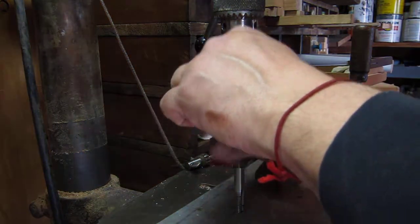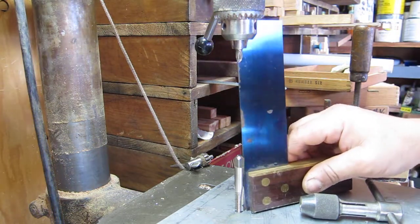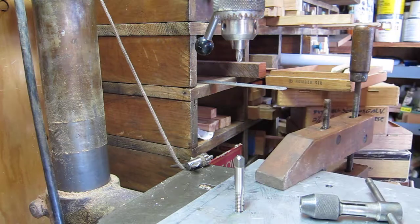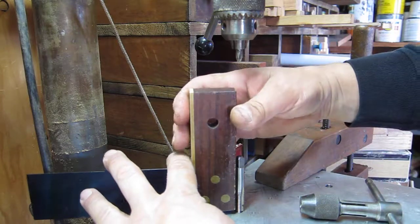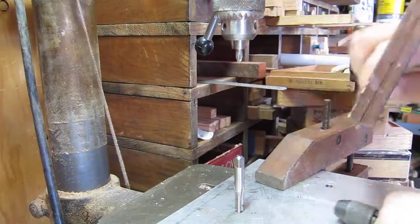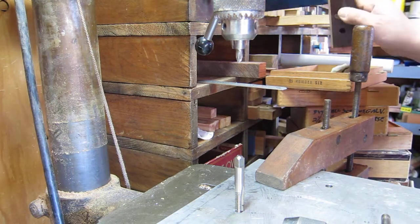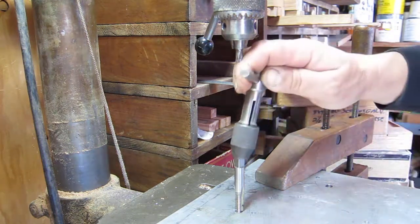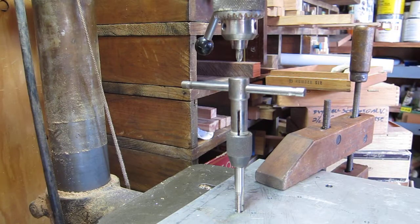Let's take this out and have a look. This way it's right on the money. See — if you look on the flat over here, it's right angle; other side, right angle; from your perspective, right angle. Very simple fix, simple way to do this. You can do this tapping process in one third of the time. I'll put it back and continue my tapping. Hope you guys enjoyed this video, and God bless.